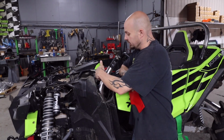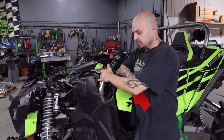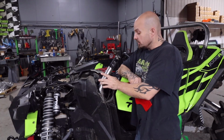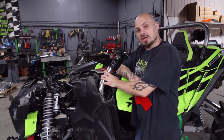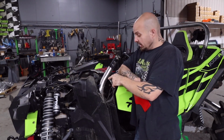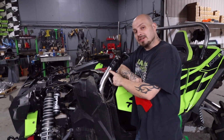And if you look under here on the front of the machine, it kind of 45s in, about a 1.5-inch tube into the outside diameter frame rail, which is a 2-inch tube. The problem is the thickness of this metal. This was a 10 or 12 mile an hour rollover. It just went up, went over, and kind of tumbled, and it actually bent the frame. Insurance-wise, this would technically total your machine because it has a bent frame.